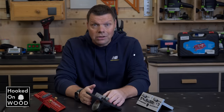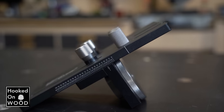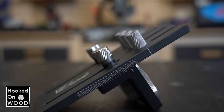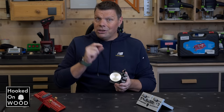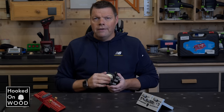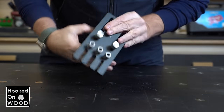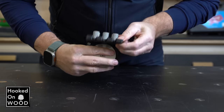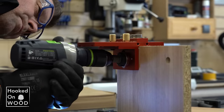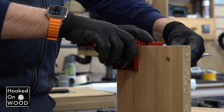There are a few downsides, at least in my opinion. The numbers on the scale and the size of the markings — this is a shame because there was room to make them more visible. What I like about the scale is that you can set it to the material thickness. The Drill Pro gives you the distance to the heart of the dowels. But what I miss is a mark to align it in both directions — there are some marks at the side of the doweling jig, but not at the center, which would make it a bit more versatile. You should also be aware that you cannot use it to place furniture screws, so it is only suited for dowels and glue.